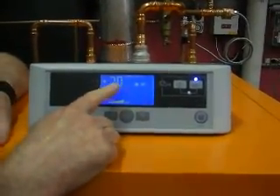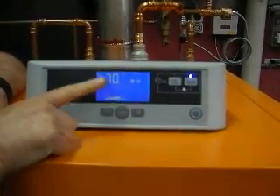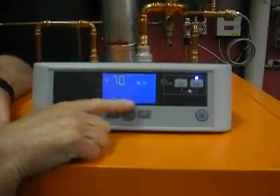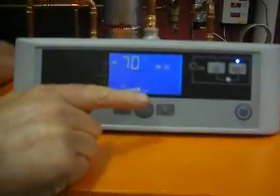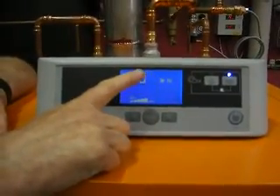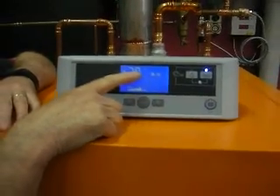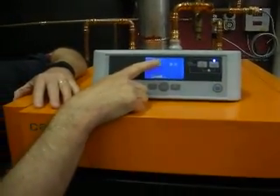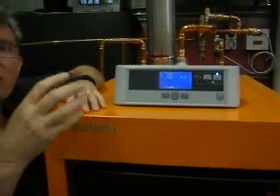Our water's still sitting up there at 70 degrees. Our circulating pump has kicked back on. And just while we're in this area, this fan at the back is a modulating fan. So as the top of the boiler approaches a preset limit — which on this I think I've set it to about 80 degrees or 85 degrees centigrade — that fan will modulate down and start to slightly choke the fire.